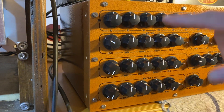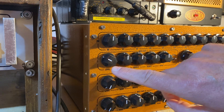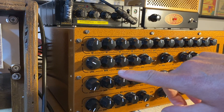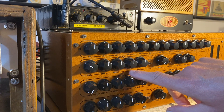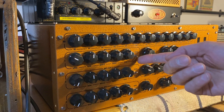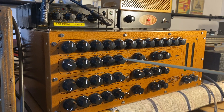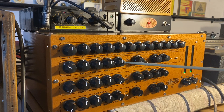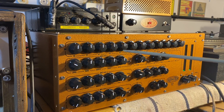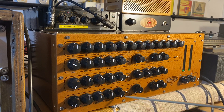What we've got in here is your gain input. You can put a microphone in any of these channels or a line level — it's got balanced sensitivity so you can use a mic or a line level in there. Then you've got a three-way equalisation: bass, middle, and tops on each of the three auxiliary channels, plus the amount of echo you want to send into the loop. You could also put a sound effects unit or a CD player on this channel, but it doesn't have a phono stage for an extra deck. This is a simple preamp — the three, four, and five-way one will be more comprehensive when it's ready.